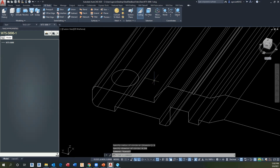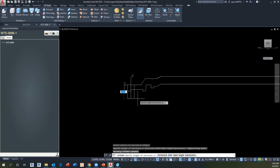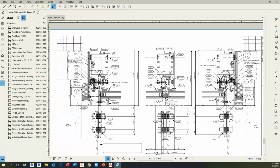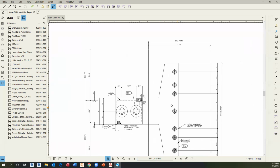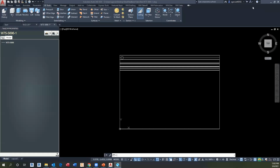You can double check if you are working in your fabs. Then I'm going to extrude that particular hole in any dimension. I'm going to use 1 there. Now what I need to do is follow what is on the drawings. If I go to my details, like file 1, when it was my Sunshade bracket, there you go. I know I'm using the B group to do the fasteners and I need 1, 2, 3, 4, 5, 6, 7 holes with the same diameter. The spacing varies according to this detail. So it's only to incorporate from the edges 1 inch, 1.5 and 1 inch. Let's follow that pattern.